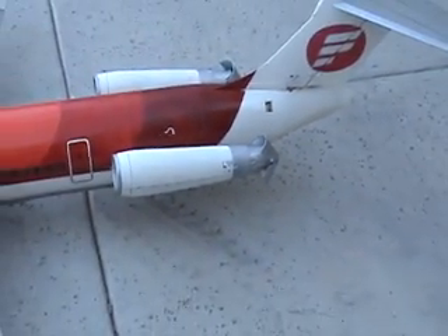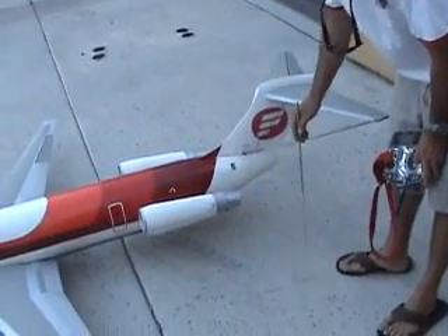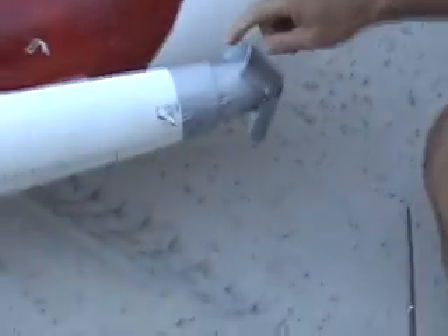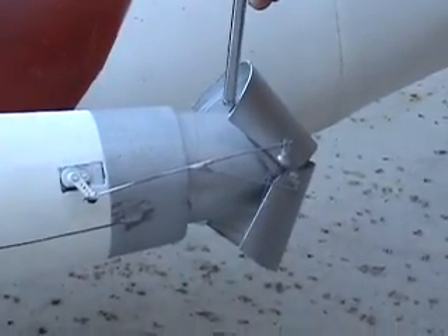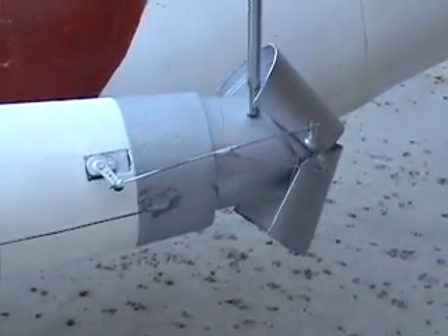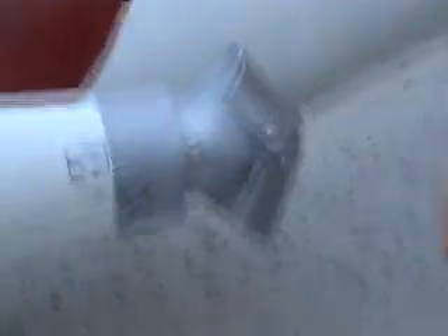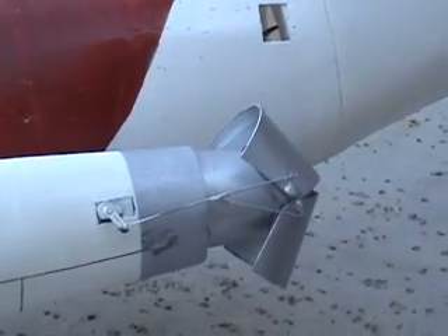We'll show in a moment how it'll back up on cement — we're a little close to buildings right now. To keep the servo amp draw low, we've used one servo per side. Come a little closer, I'll show you this. The actual doors — the mechanism for the movement — are made out of spray can tops, and they're pinned with sewing pins here to hard points inside this foam cup. The geometry is such that it can seal and it closely replicates the real thing, but not exactly. For modeling purposes, we couldn't exactly machine something heavy that would actually come back and away on arms.